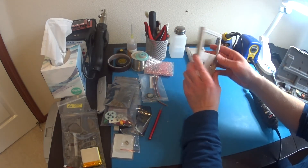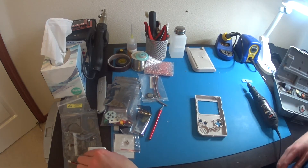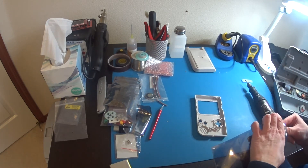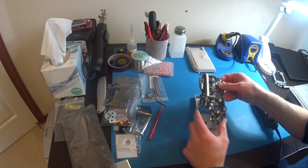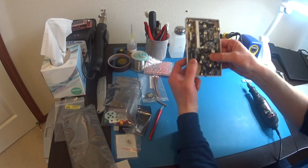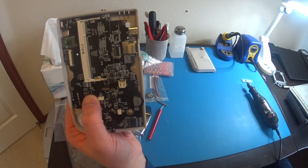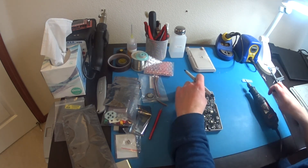I'm close enough on this now where I'm good for a little bit. I'll clean that back up later kind of off camera — that's just going to burn up a lot of time. It's probably going to take me another hour just being a perfectionist. So what I'm going to do now is take my CircuitSword board and kind of lay it into the front shell, like so. I need to mark a few things — on the upper right-hand side that USB-C port, and down below that the digital volume rocker. The CircuitSword doesn't normally have that volume rocker — I added it, so now I have to deal with it.